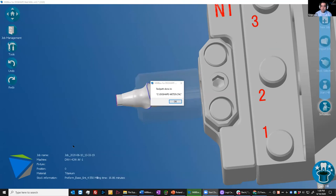James asks: how do you feel the machine will hold up if abutment milling is the primary job for the machine? With the special purpose tray that's designed to collect the titanium remnants, there's no effect on the filters or the pump because none of that is getting into that area. As far as spindle wear goes, R&D in Japan milled just over 500 units and showed no significant wear on the spindle as compared to milling ceramics. I hope that answers your question.